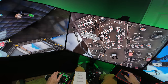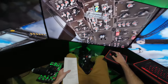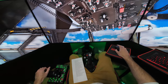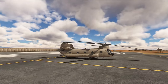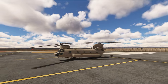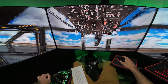And then we'll turn our EAPS fan switch — both of those guys are on, that's all these switches up here. On, on, and then open those doors. And then we'll turn all our left fuel pumps on and our cross-feed switch on. Then we'll go ground on our engine number one lever, and we'll take our engine start switch and go to number one. Start to see everything spooling up. Good oil pressure there, so we'll go ahead and take that to flight. We'll turn our generator switch on for number one.